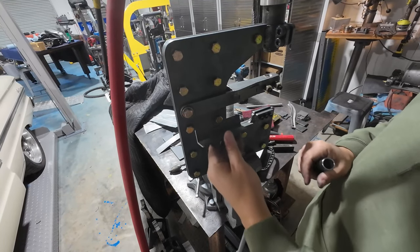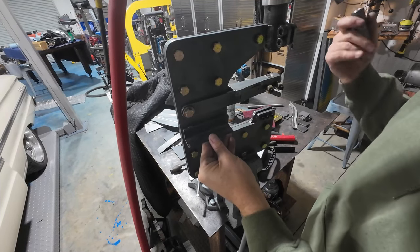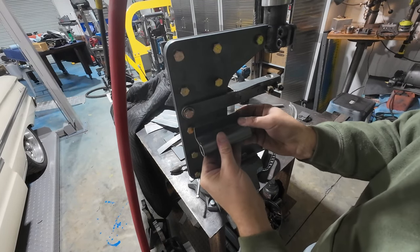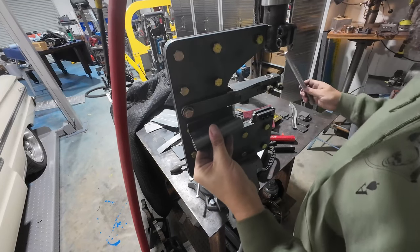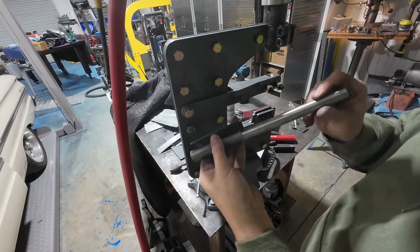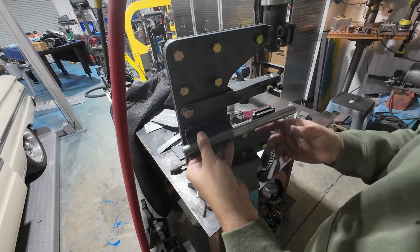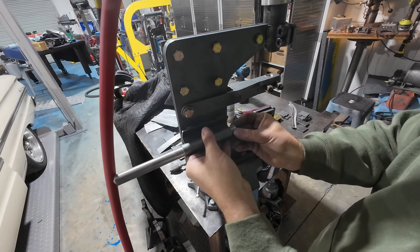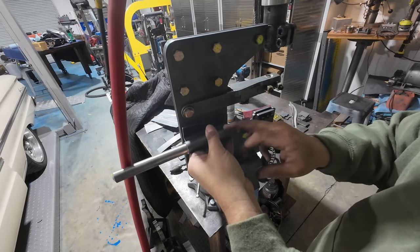I've determined the best solution is to use some 90-degree angle and pick up these two holes — so this is going to be a bolt-on solution after all. Then I'll come in behind it and weld this pipe along the angle on both sides. I've got my rod here, my dowel that I've turned — it's about 30 thousandths undersized so there's a lot of slop in there. I'll have one on each side and that's going to be my depth, running all the way back so I can get the full depth without removing anything.